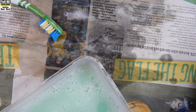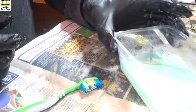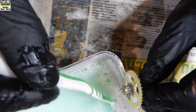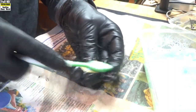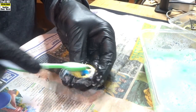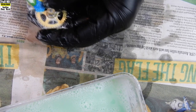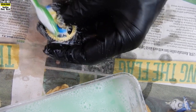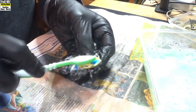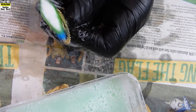Okay, that's a wheel. We'll drop that into the water. Now, grab the next wheel, put it in our solution, let it get wet. Right, back for our next wheel. Take it out. Our solution. Once again, same story. Start scrubbing away on the top of the wheel this time, because the lantern pinions up there, will break the tradition and start at the top. Running round meticulously on the side of the wheel and also the teeth, then back to the lantern pinion.